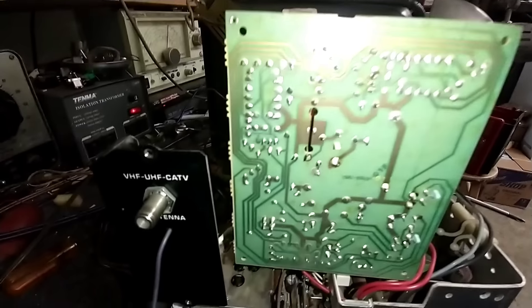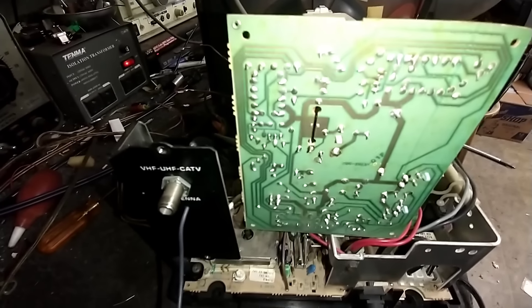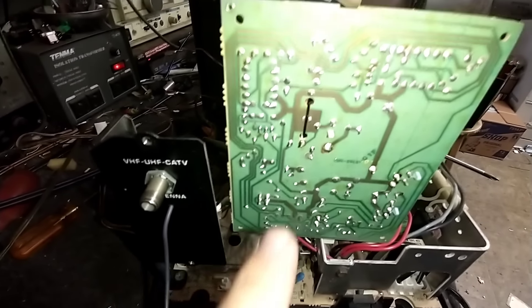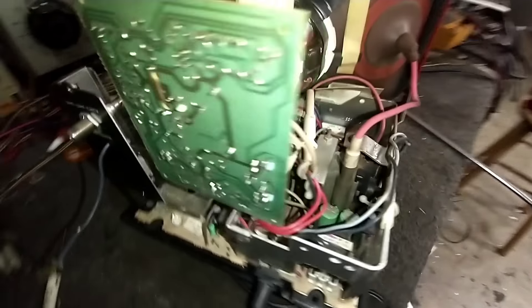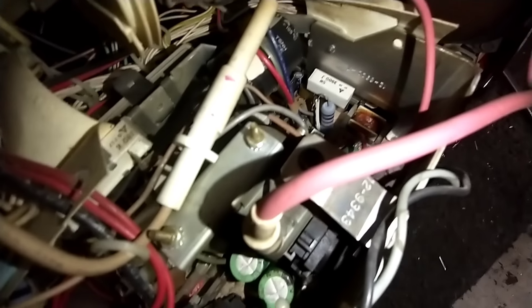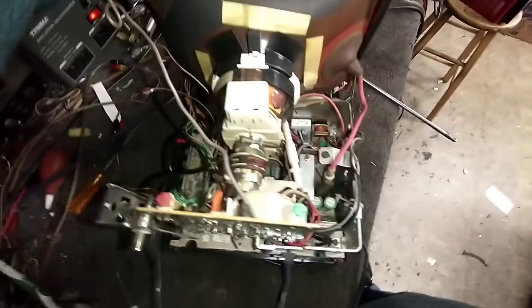Not the best way to start your day, but whatever. Checking the board soldering — not the greatest, but it's hanging in there. There are a couple of loose connections here for the CRT, which is kind of important. Didn't really confirm the intermittent brightness problem, but I'm sure those caps down there are baked. And that one hiding underneath the wires is probably a D-filter that's baked.